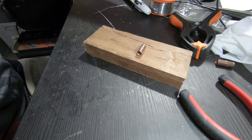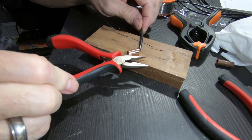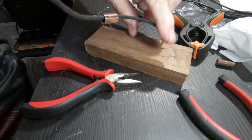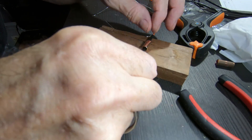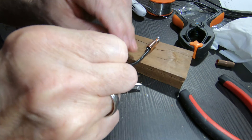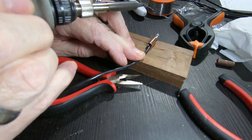What I'm going to do is put my wire through that side — the other side — and pull my microphone through this side. That's hot. Roll down on this wire all the way down here. Now it's there. Pull this on, put the wire in there, put the ground wire, and pull it through. Twist it around to where that ground wire that's already tinned is touching the solder I already put on there. Now all we have to do is heat it up and make it flow.